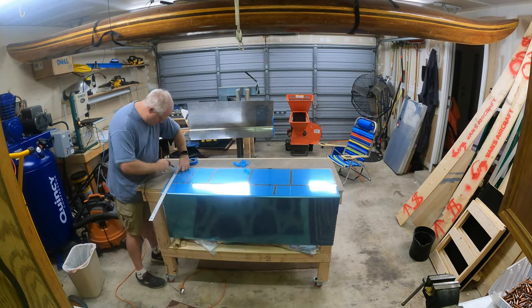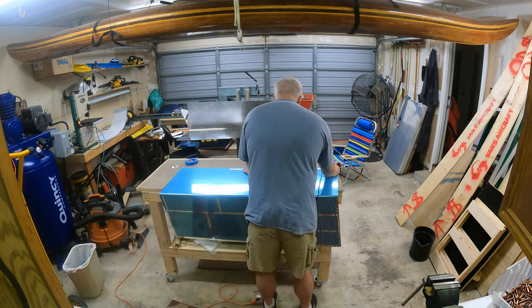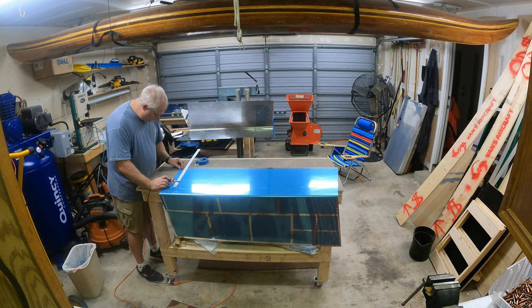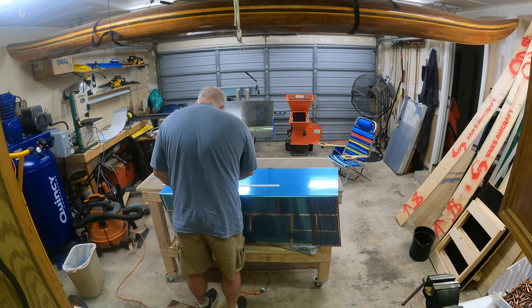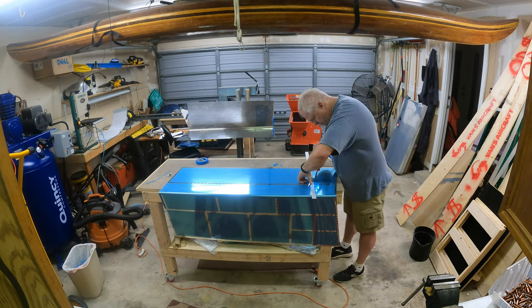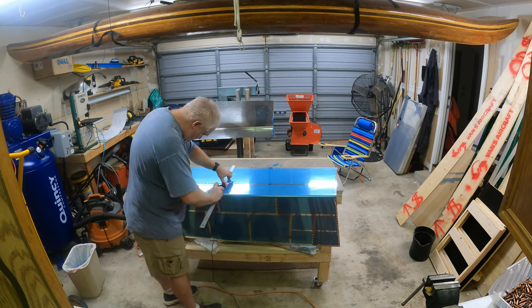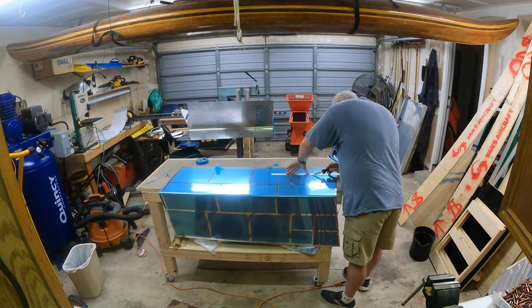You can start seeing where I've taken off the vinyl exposing the holes that I need to dimple. I still need to deburr the edges of these skins — that's what step one has you doing. I'll be doing that later today as well as hopefully starting to get these skins dimpled. I'll be using the DRDT for that dimpling. All right, thanks everybody, talk to you later, bye.